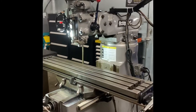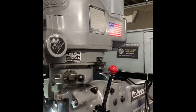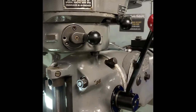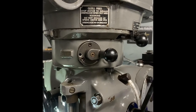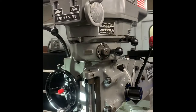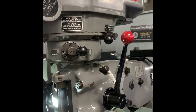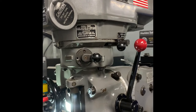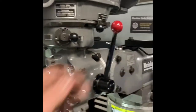It's all done. Screw came in, did the motor bearings. There was one other thing in the transmission housing — when I'd run it in back gear, I could hear one of the teeth clicking. It bothered me. It was really subtle, but I knew there was a chip stuck in the grease. So I took it all back apart, cleaned the new grease out, found the chip stuck to the gear tooth, took both gears out, cleaned them again, and put it all back together. Now it's nice and smooth. I'm very happy with it — turned out really nice.